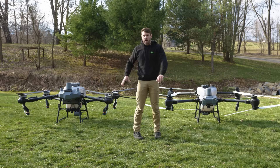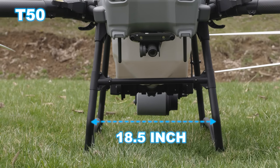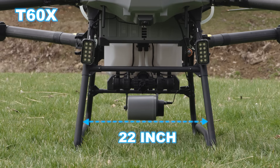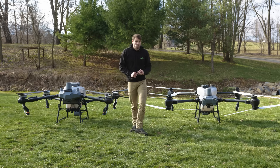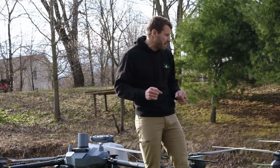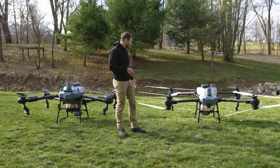The next big thing you're going to see on these two drones is the legs. The width of the T50 is about 18 and a half inches wide, and on the T60X the legs are about 22 inches wide. So it has a little bit more stability — maybe with that 22 inches because it's carrying a bigger load, that's probably why they did that. But again the T50 is very stable at 18 inches.